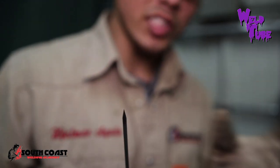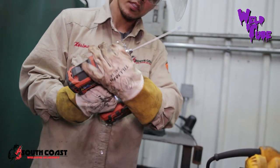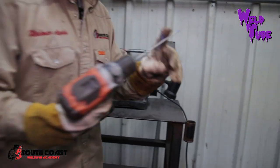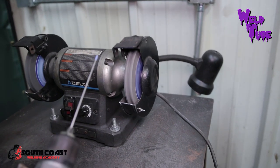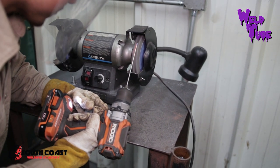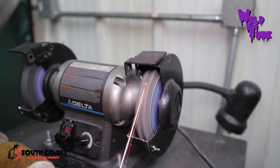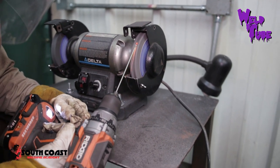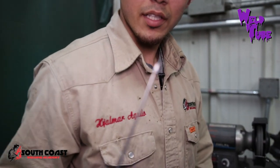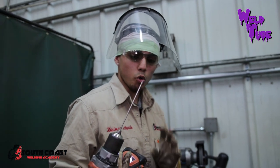Now I'm going to show you another way, which is a much faster process. Sometimes in the field you can have a drill — take it with you. Got the drill, lock the tungsten in place. This is a way faster process. Turn the grinder back on — it's going to be real fast. And we're done. See? That was at least five, six seconds. So this is a very fast process. If you don't have enough sharpened tungstens, you can do it real quick with the drill.